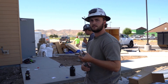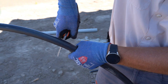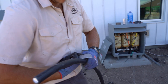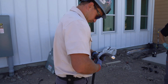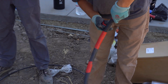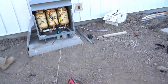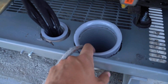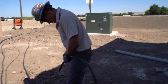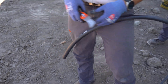We're stripping this 700 — trying to make the head a little smaller so it goes in the conduit easier and feeds better. We've got to fit four of these 700s and the ground, which is a number four, all inside this 4-inch conduit. Four inch is pretty big, but when you're trying to fit four 700s and a number four, it fills up in a hurry. So we're going to strip the ends of the insulation off these wires, and it'll make it a little bit easier to build the head so we can pull through.